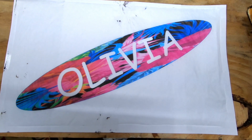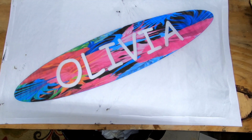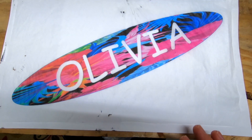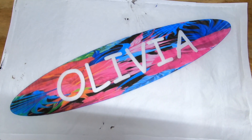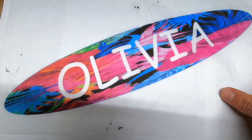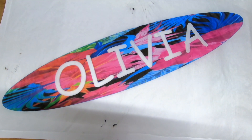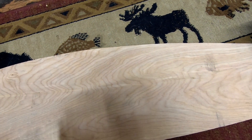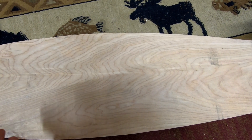I'm making this board for my daughter for Christmas and her name is Olivia. So I came up with this new way of how to — if you want to call it printing onto wood. What I do is I take regular printer paper as the backer and then I use tissue paper just like you would use when you're wrapping a gift, and I tape it onto it and I print it through the regular inkjet printer at home, and then I cut out the tissue paper. Then I take regular clear coat, like lacquer clear coat, and I spray it onto the board. I spray it onto the board and then I lay the tissue paper with the graphic into it, and the tissue paper pretty much disappears and you're just left with the graphic in the clear coat of the board. So I just wanted to kind of explain that before we go ahead and do the process.